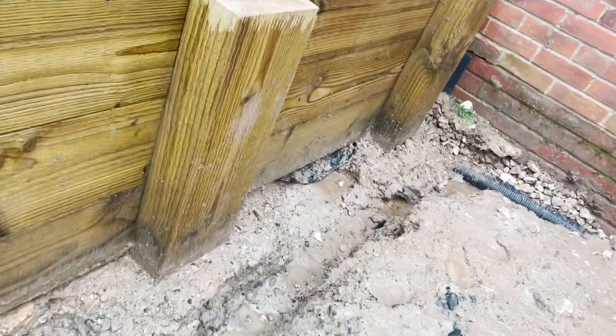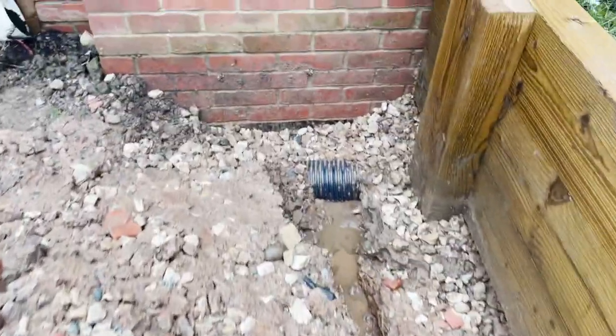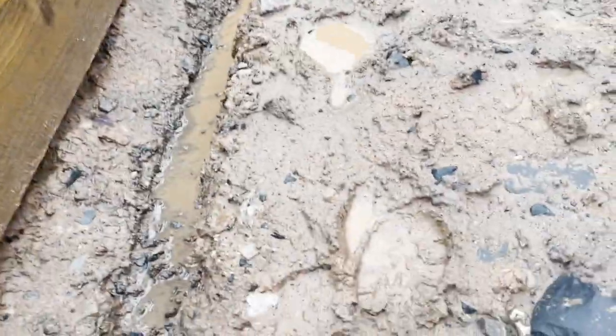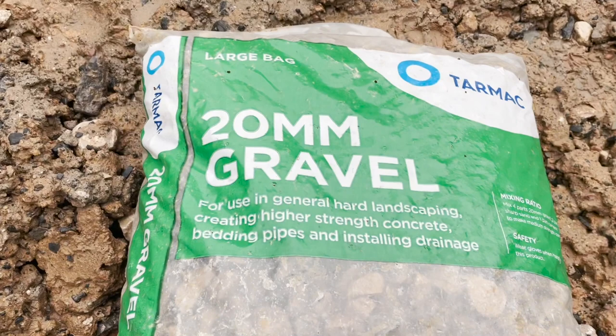The plan for today is to dig this trench a little bit deeper and see where we can go from there. After the final day of digging, you can see the trench goes all the way down to the pipe. It's perforated so it will drain off. There's a slight decline all the way, and the distance between the wall and the water in the trench is quite far, so I'm hoping it'll keep the water away from the wall — that's the main goal.